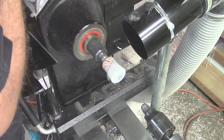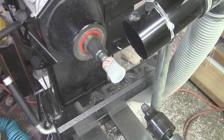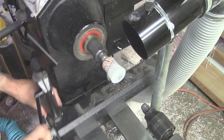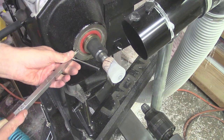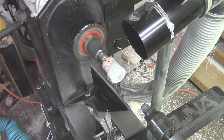I'm just going to change out the cutter on this to the negatives. And if you're doing resin turning, I kind of take it for granted because since these came out, I was all about them, the negative rake cutters. If you're having any issues with resin turning, if it's kind of chippy or anything, seriously try the negative rake cutters from Easy Wood Tools because they really help a lot.